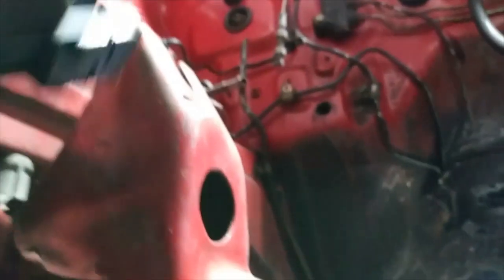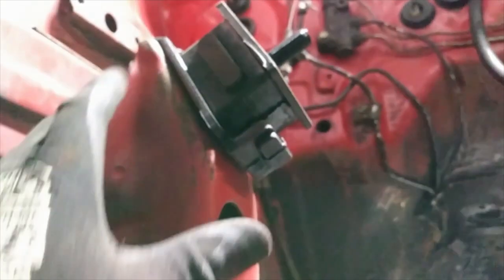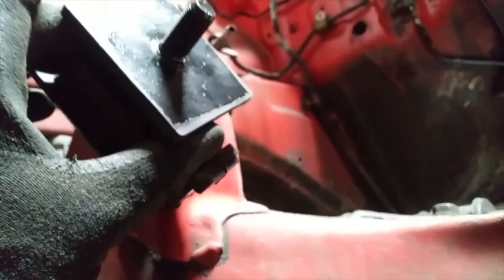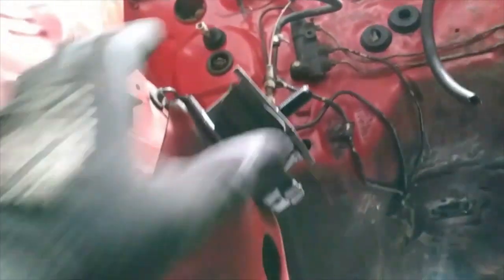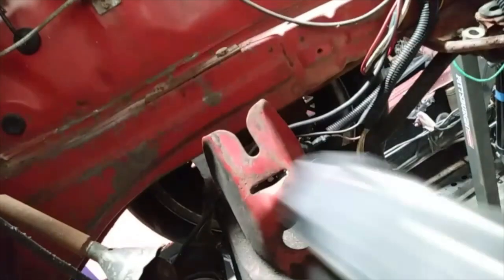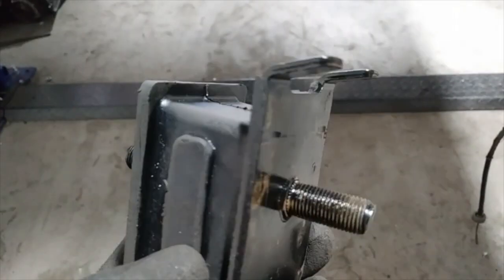I came to fit this mount — these are twin cam mounts on this bracket, and there's a little lip that keeps it from sitting flush, so I've got to knock that down a little bit and flatten it out in order to use these rubber mounts. That's the first one in place — it's secure, tight, and snug, not going anywhere. I also had to bend these tabs up just a little bit.